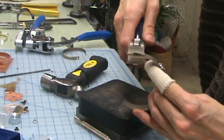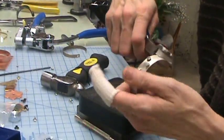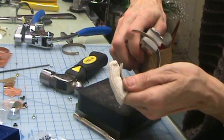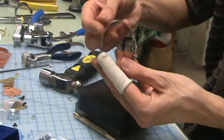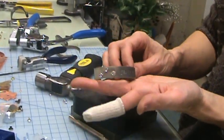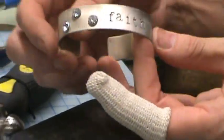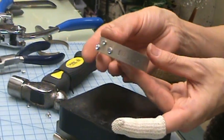This doesn't bend it quite sharp enough into a bracelet shape right away, so once I get my basic shape I just use the benders to bend it to about what I think it's going to need to fit. I usually use my own wrist as a guide — it depends on who you're making it for, as the bracelet may need to be a little wider or narrower. This is a basic piece of nickel that has been stamped, we added some rivets, and once you polish it up a little bit it's pretty shiny, sparkly, and lots of fun.